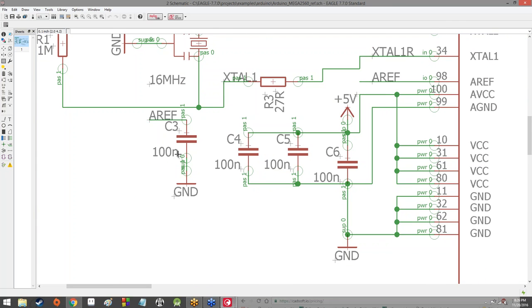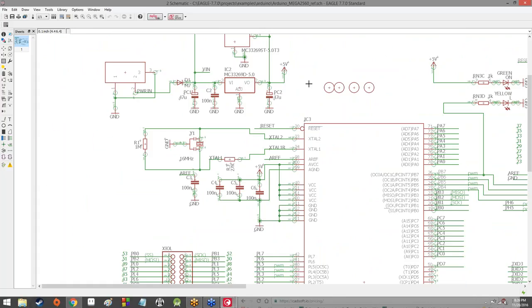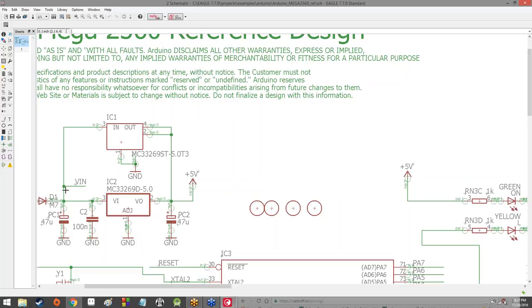So you've got capacitors and resistors and diodes and connections to power and ground and stuff like that. Then you've got these green wires which denote connections that exist. If we look at this IC1, integrated circuit 1, we can see it has four lines that come off of it that are all numbered. One connection is connected to ground as well as another part of the Arduino. Another is connected to power, as well as a couple of diodes and another IC labeled IC2,